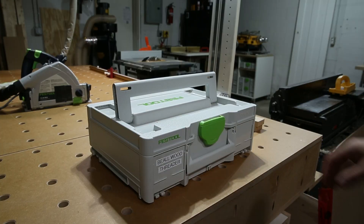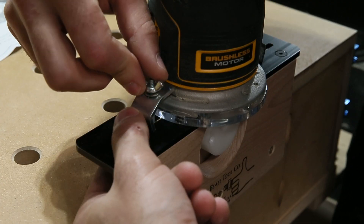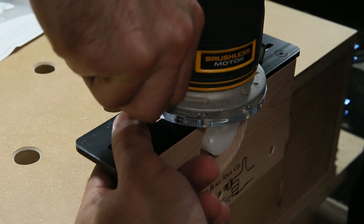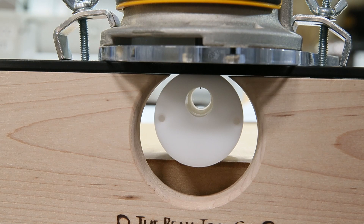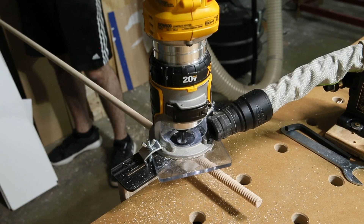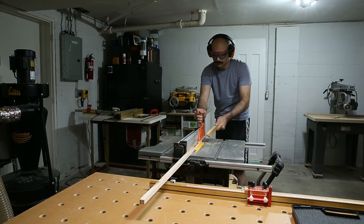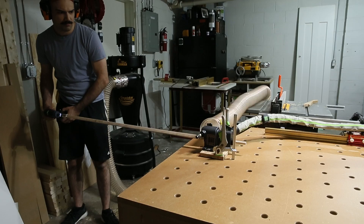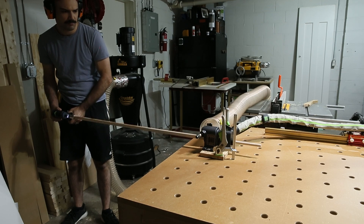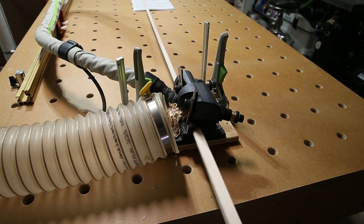I really didn't want to go to the hardware store and I thought this would be a fun opportunity to cut some wooden threads, so I got out my Beale wood threader. This device uses a router to cut threads instead of a typical screw box. The plastic inserts are threaded on one side and the v-shaped router bit sticks out inside the channel right in front of the threaded portion. Once you get the thread started the rod threads itself into the insert and you get a very nice thread. I needed an accurately sized half-inch dowel so I cut a length of hard maple to five-eighths inch square on my table saw and fed it through my Veritas dowel maker.